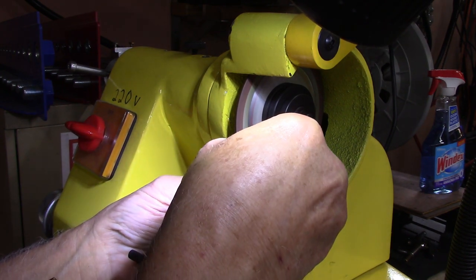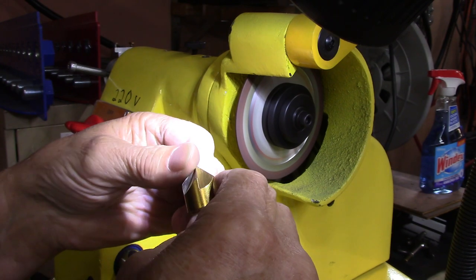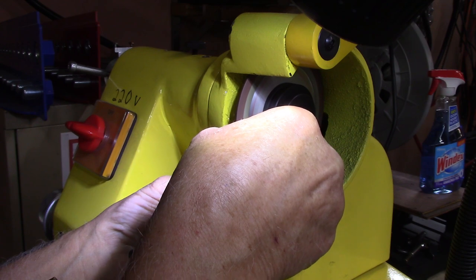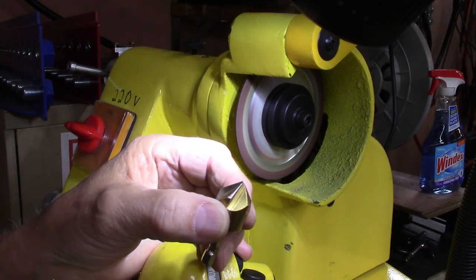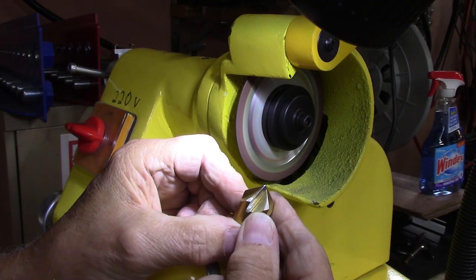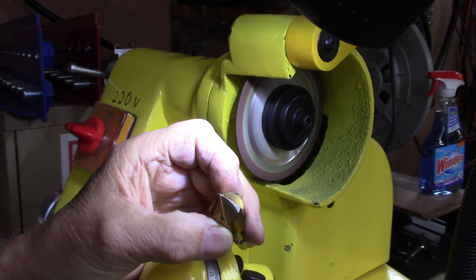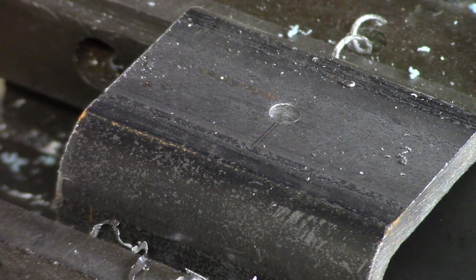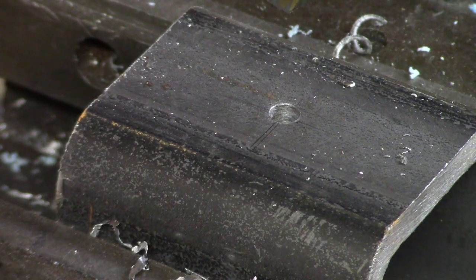Let's see here — the flutes are exactly straight. It's going to take a little bit of maneuvering for me to hold it just right to get a little bit of the back angle on it there. So it appears that I can get an angle on it to make it feel sharp. I've got five angles to do there; I'll do those and then we'll drill us a hole and see if this countersinks okay. I made a hole there that would accept a quarter-20 tap just right for a 50% thread, so let's see if I can countersink it good and proper.